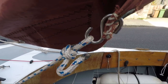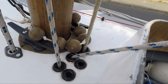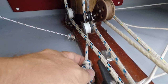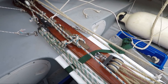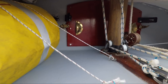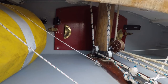The downhaul tackle has been a significant misjudgment on my part, and a major factor in the poor sail trimming for many years on board Arwen. Here is my new arrangement — it runs down through the deck, bringing the sail tack much closer to the mast base and the parel beads. Lengthening the distance between the blocks has enabled me to gain far greater downhaul tension, and hopefully this will go some way to eliminating the sail creases and giving better luff and leech tension. The messy arrangement shows my inability to understand a simple clear and concise rigging plan instruction, and whilst it looks awful, it does actually work.